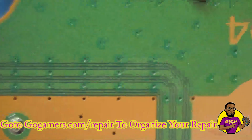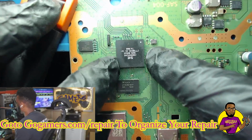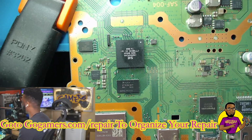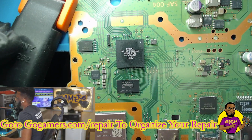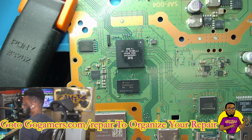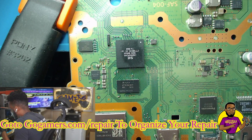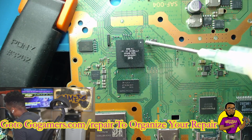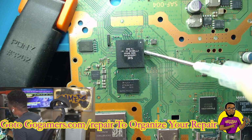But let me find the chip. All right, cool. So you can see we're right here. This is exactly where the Southbridge is at. The thing is, these things go out so often in the PS4 Slims. I have no idea why. It's usually either the HDMI IC or the Southbridge. So let's go ahead and replace this chip.